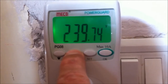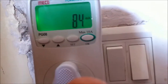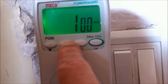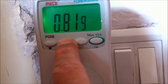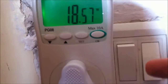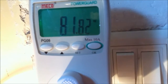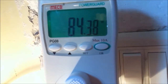Right now the voltage is at 240, 239 volts. The current I'm getting is 2.55 milliamps — it keeps varying; maybe about 1 milliamp is what I'm generally generating. This is my power factor. That's the watts again that we're generating. For some reason it has gone down to zero — I think there's a loose connection, that's why it keeps fluctuating, otherwise it's pretty stable. Turning on the bulb gives me 84 watts, and turning off the solar gives me 104 watts.